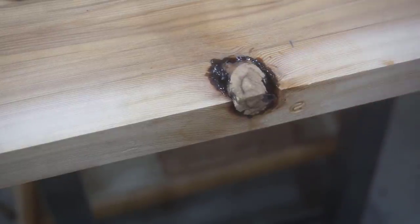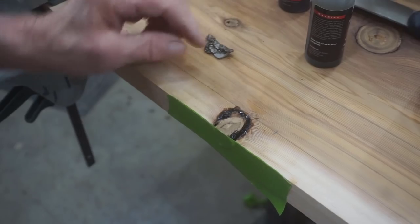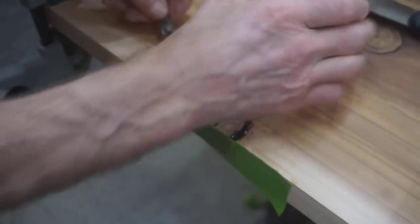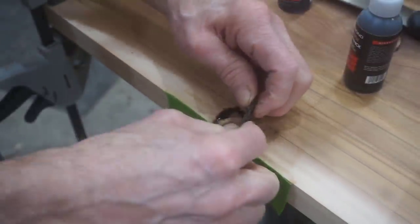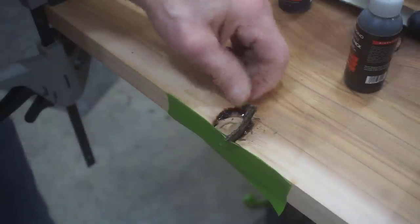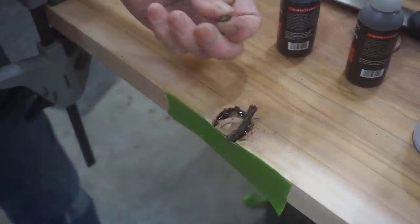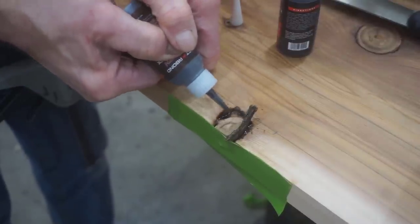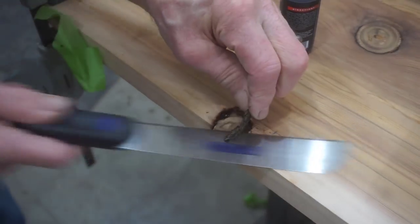That's looking pretty good. There's still a gap on this side of the knot just because the bark chipped away from that piece. I'm going to add some tape and drop a piece of bark down in there — basically replicating what happened. I'll accelerate the bark and wedge that piece down in there. The accelerator on the bark will cure the CA in the gap. I'll add another little chunk with accelerator and some black CA. Pretty much anything goes for filling up that gap because if you study the way a rotten knot looks in a piece of wood, it's pretty irregular and varied on its own — so all I'm doing is replicating what occurs naturally.